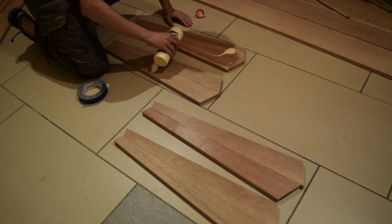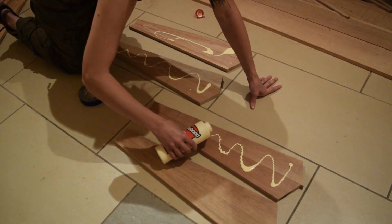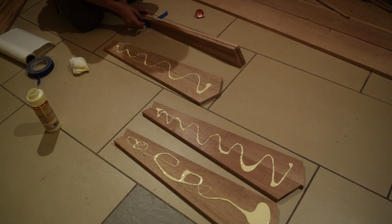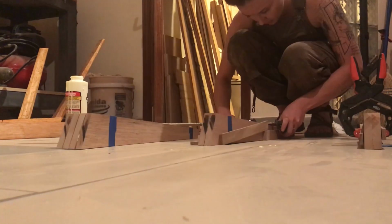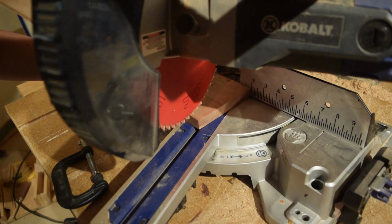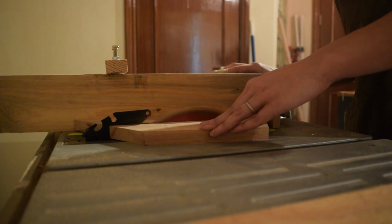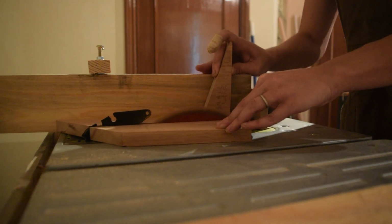I glued 2 panels of the long legs together to achieve a more aesthetically pleasing width for the front legs. Then I used tape tension for placement and clamps to ensure a nice adhesion. I used the same measuring, cutting, and tapering methods for the short legs, but I left the shorter back legs as a single panel, mostly because I thought it would be a cool design feature.